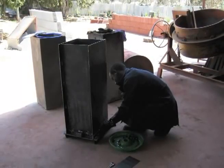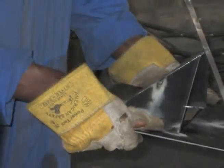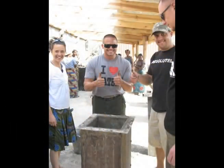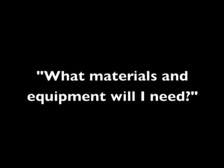It's always a good idea to show them pictures from the manual or this video. For reference, a Biosand filter mold is much like a brick maker mold. Set up a contract with your welder — it should state that you must have a working mold which has been tested and produces a working concrete filter before you will pay in full. We recommend that you always make safety your highest concern when building a Biosand filter mold. Make sure you know how to use all of the equipment you need and wear appropriate protective gear. Alright, let's have some fun and get building.